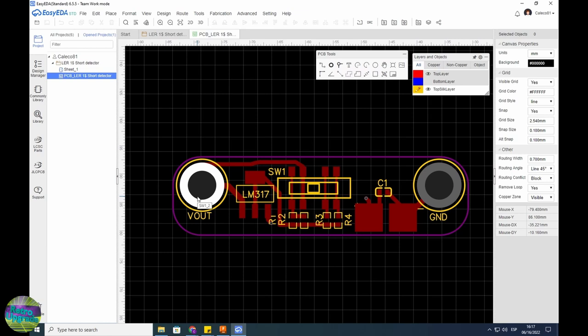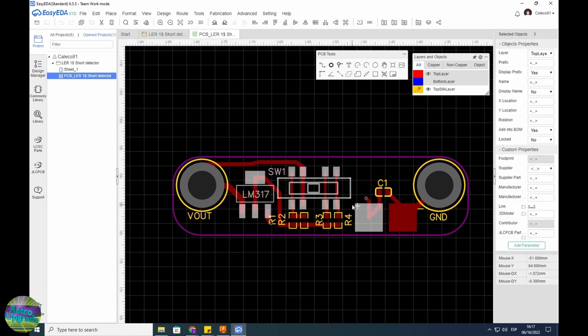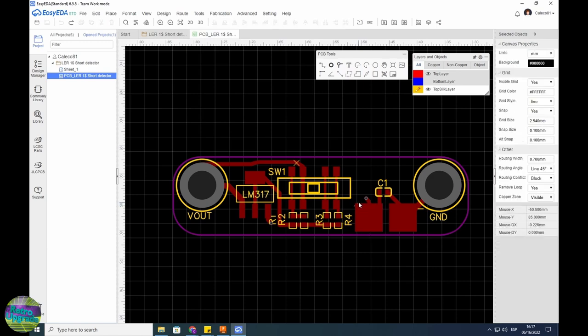The switch goes here, the resistor net is here, and we have the LM317. I minimized the space needed, but I still made it bigger than Detlef's because we need some bulk — we're going to mount the PCB with the banana contacts, so we needed a beefier PCB so it doesn't break under strain. The batteries are soldered here — this is the positive, this is the negative.